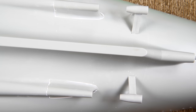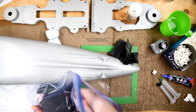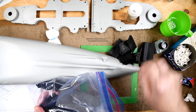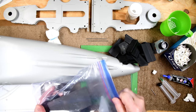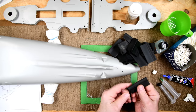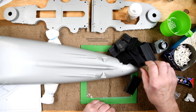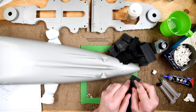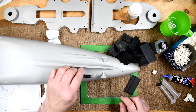I think I just saved myself a lot of work with the sandpaper. I bought these sandpaper profilers from Lee Valley about five or more years ago, and I think finally I'm going to be able to put some of them to good use here. For instance, this one here — you put the sandpaper around it and it will give you a radius like that. And this one here is just about the right radius to go around this. So when you go back and forth, you get the idea. I'll probably be using this one.